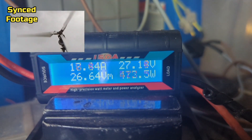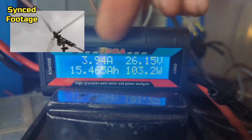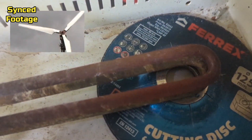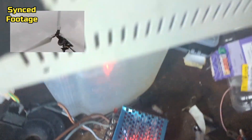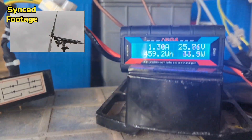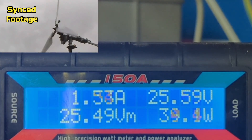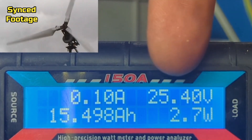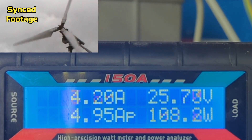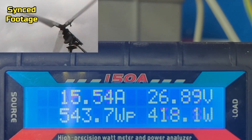At the moment we're drawing just over 300. This meter shows the power coming in from the turbine and I know for a fact that it uses about 12 amps — you can see it starting to glow red. I'm leaving it on, it's connected to a speed controller, on 100% until that is glowing. Bear in mind you may see the voltage drop of the battery because there is that pull from the dump load.